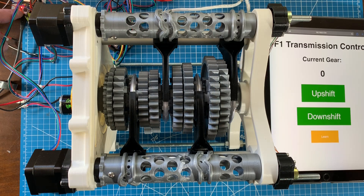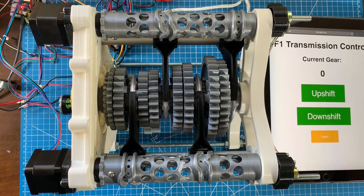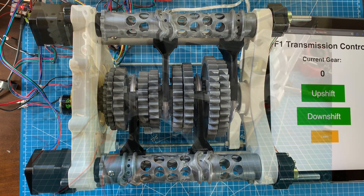I've also created a diagnostic program that runs at startup to detect whether the stepper motors are plugged in backwards or if the potentiometers are miswired. As you can see, it does a few steps one way then steps back on the right barrel, does the same to the other barrel, then steps back the other way — all while checking the pot values to verify it's moving the right amount and in the right direction. Once I get this back together I'm also going to add code to test the RPM sensors so I can diagnose any issues with those as well.